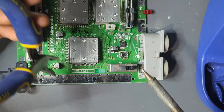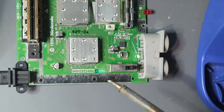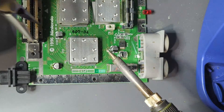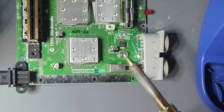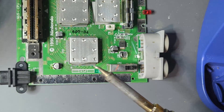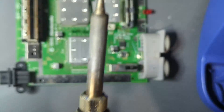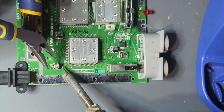I'm going to grab something to hold it and go from both sides, let it heat up, and then pull it off. You definitely don't want to just rip it off — if you rip your pad, that's not going to be good. Take your time, go back and forth. As it comes off, there's a little bit of plastic at the edge — that black ring — that may get on your soldering iron and it won't smell good. Use a tip you're okay losing. I do have a heat gun but I don't want to set that up right now.